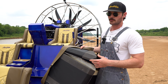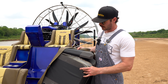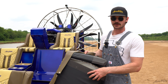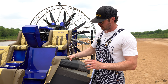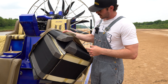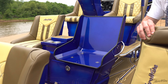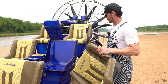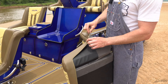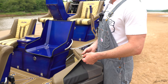I'm going to pull off one of these seat covers so we can take a look at the back of it and how it's constructed. We build all these in-house — everything's cut on a vinyl table, and all the pads are custom cut and shaped to fit these seat buckets. A really cool part about our design is these foam pads are interchangeable, so we can go with lighter density or heavier density foam depending on what kind of feel you want. They are removable, so if they wear out over time we can swap them out without having to ditch the nice cover. Same thing with the bolsters — they slide in and out, so they are also replaceable. Looking at the seat pod, we wrap the seat bucket in a full protective trim so that none of the abrasion from the seat ever rips through the vinyl.